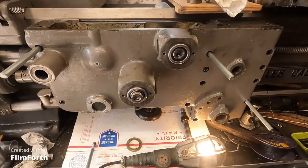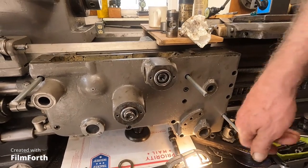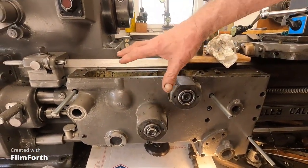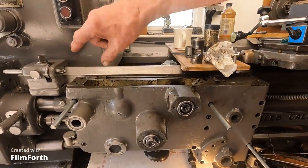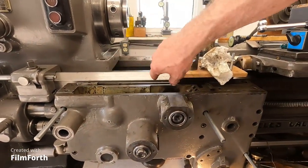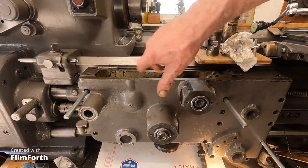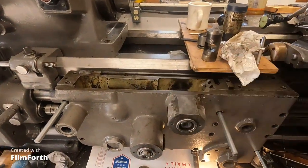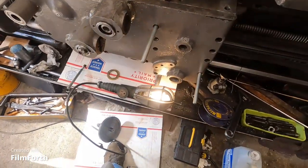I mentioned I had this cranked all the way over. I was cleaning up the cast iron chips and then I could rotate the wheel but it wouldn't go anywhere. I was having problems with these clutches too, and then everything gave out - but that was just a shear pin on the pinion for the rack. I just made a better pin for it - a little larger diameter - and tightened that up.